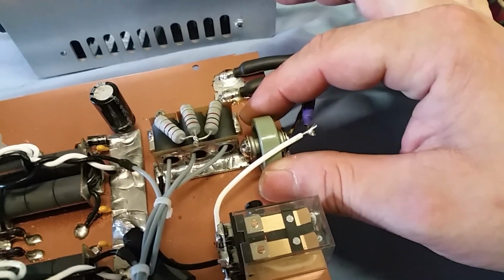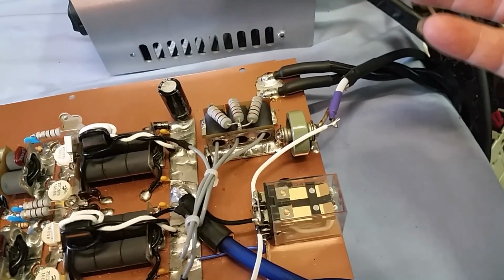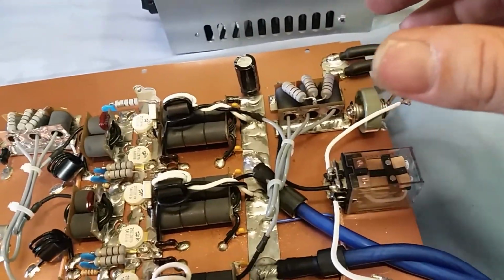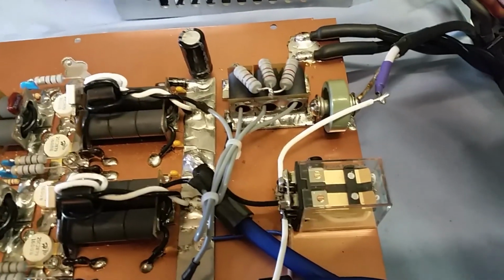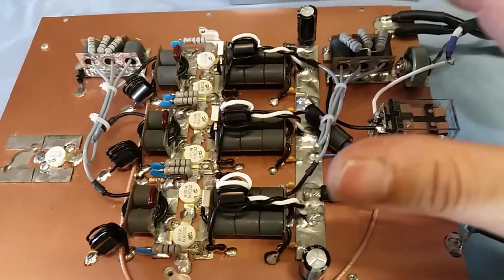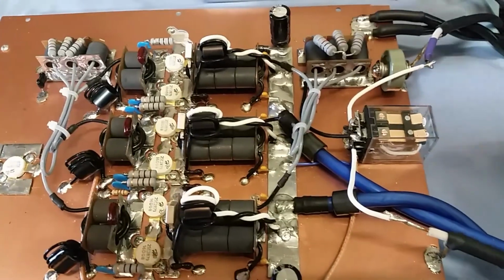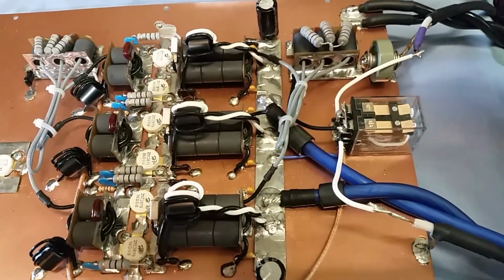But anyway, here's your output tuning load right here. Believe it or not, this actually tuned out to around 150 or so, about 152 I think, which was unique. It usually tunes out to about 82 to 100 on the Toshiba boxes, but these are HGs, so the tune can be a little different, which is understandable. So got you a good doorknob right there, man. Usually I'm pretty good. The way these tune out, I'm usually able to use a doorknob or some high voltage ceramic disc because of the value of the tune. I usually have some stuff in stock for that.